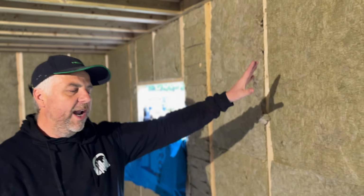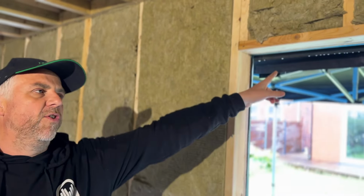This room isn't going to have air conditioning, but what we're actually going to do is put a rotary isolator switch down somewhere in the room on the outside, so in future an air conditioning system could be retrofitted. So I think that's going to go on this wall here. The lighting bank's going to go here. We're going to have an outside light over the door on the outside. The other thing is the fan system. Even if you've got aircon, we have our own fan system which we use, which we're going to get to, but we're going to need to put a feed in for an external fan.